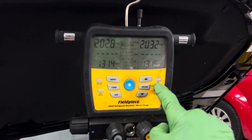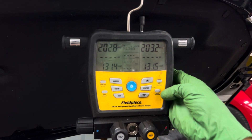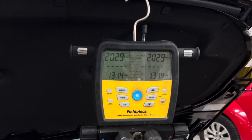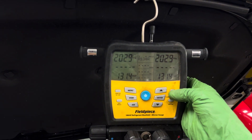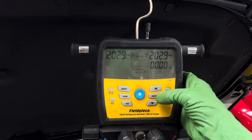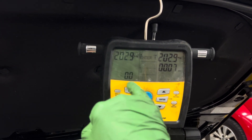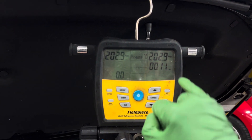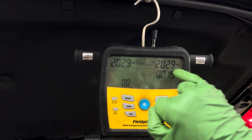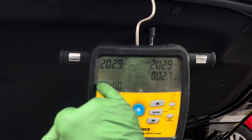If I didn't wait and just rushed into it — you see where it says 'tightness test' — let's say 10 or 15 minutes went by. Go right into tightness test, make sure the nitrogen's off, open up the other side to equalize, then hit tightness test. Now the counter is ready; it says 'press enter to start.' This will show your loss — you see where it says 0.0? This reads in tenths of one psi — not even one psi, tenths of a psi. You can see the timer going, and from this moment on it'll keep track of the pressures.